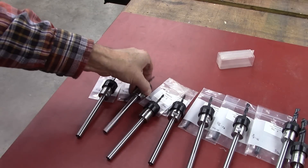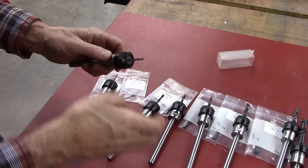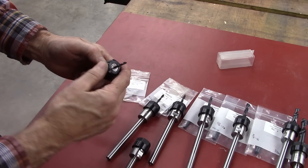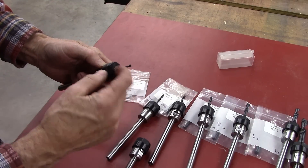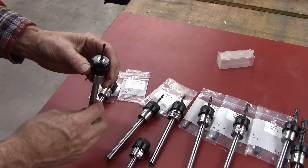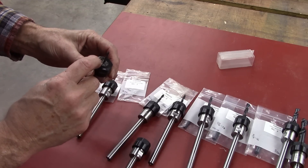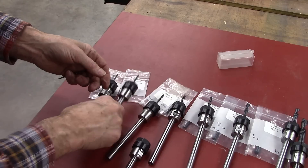I had a phone call and forgot to turn my mic back on. What I did is I tightened the collet all the way down and drilled it out — didn't drill it out to the full size, just slightly over what it was — and it worked great. Just enlarged the collet size a little.